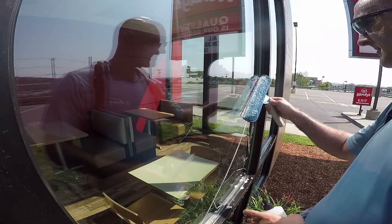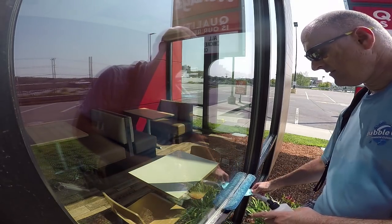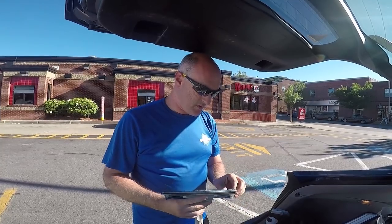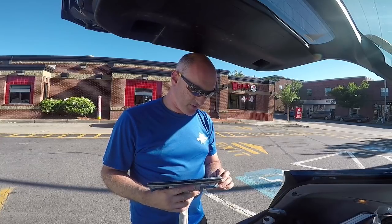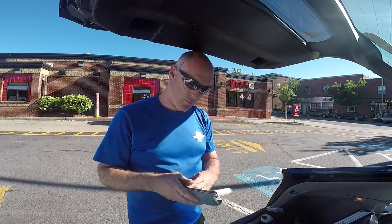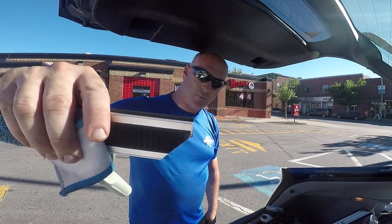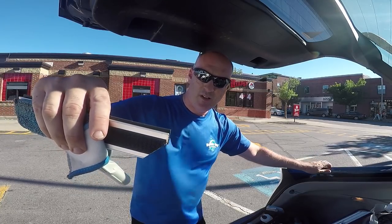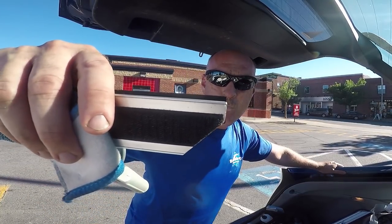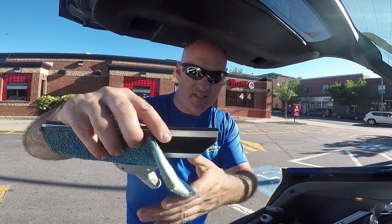You get those skips. And then as you tilt it back towards the glass, you get the good action. So there's just one thing I want to show you, one more thing, and that is zero detail with the High Flyer. If you are working with windows that don't have seals on them, like residential, you just cut it flush like that and it'll really minimize your detailing.